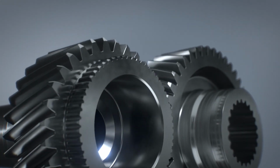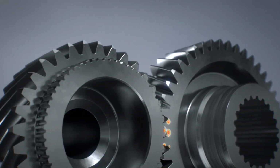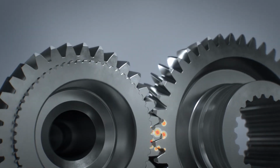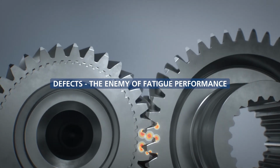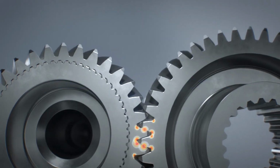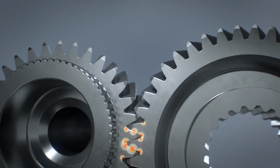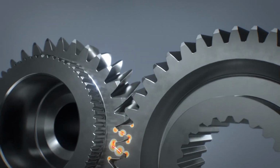Industrial applications require steel components to be increasingly lighter, stronger, and reliable. They need steel to be strong, but most of all, they need steel that can resist fatigue, because fatigue is responsible for the majority of all service failures. Fatigue happens when a metal component fails when subjected to a number of repeated loadings, even when the maximum load is well below its nominal strength.